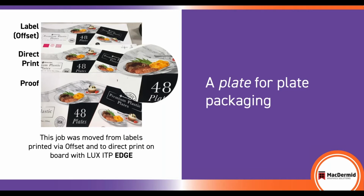This particular paper plate job, again, was always done litho label offset. They decided to go ahead and try to run it in flexo post print at 150 LPI. And as you can see, laying the offset label, the direct print, and the proof together in the same package, it shows excellent reproduction.